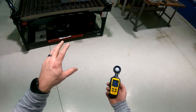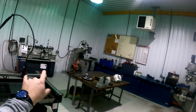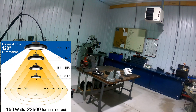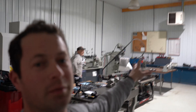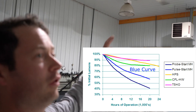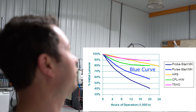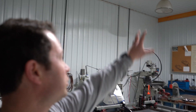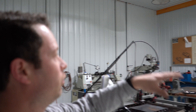That's just replacing two of the six lights. Even looking at the far side of the building, it's brighter because these lights project a fairly large diameter path at a 14-foot ceiling height. With only the two LEDs in this entire 24 by 40 foot section, it seems almost as bright as it was before with all six metal halides — which are aged and have probably lost around 40% of their original brightness over time. The LED form factor is tiny, they give more ceiling space, don't need a big deflector, spread the light well, and are way more energy-efficient. These burn 150 watts and advertise 22,500 lumens. The 400-watt metal halides supposedly put out 24,000 lumens, but the LEDs are clearly surpassing them in this real-world test.